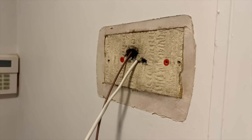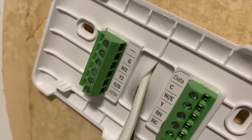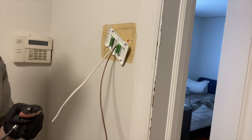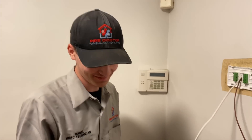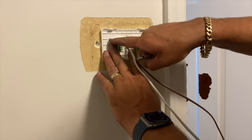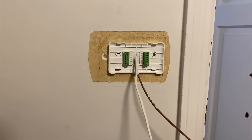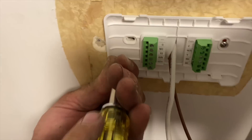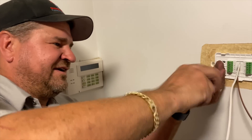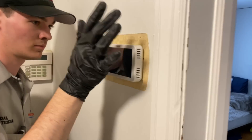You've gotta love it when you see the original wallpaper from the 1920s in the wall. The thermostat base has a little rubberized gasket that keeps any drafts from affecting the operation of the thermostat. Since the wall isn't level, I'm going to be like MacGyver — I'm going to put a screw right there, penetrate the plaster, and behind that plaster we have wood lath. This screw is going to get to that wood lath. Smash that thermostat against that base plate.